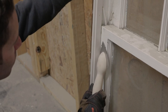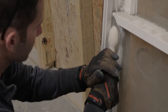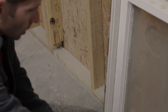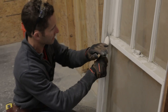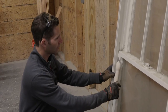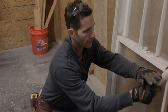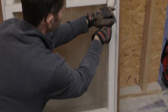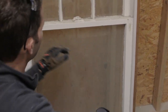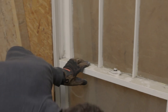I'm going to work into this area to cut free the paint and caulk that is in there. You slide it along on the face of your sash — see, it's not scarring my sash at all. You can see it fits in here very well, and then you can use it in a sawing action or just pull to get that freed up. I'm going to do both sides to cut that paint line. You may or may not be able to move the sash yet because you still may have paint on the outside. Still not going anywhere, but I've cut the inside free at least.